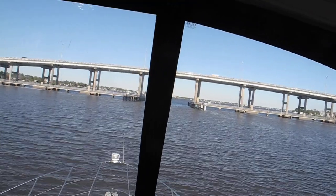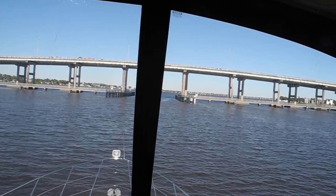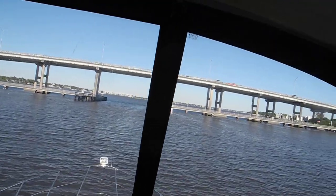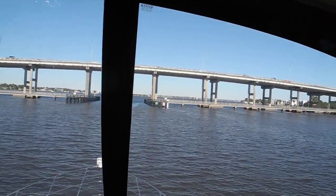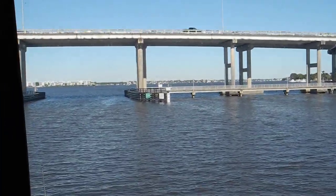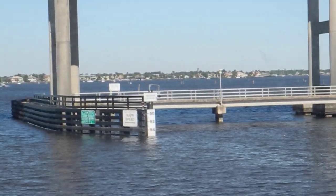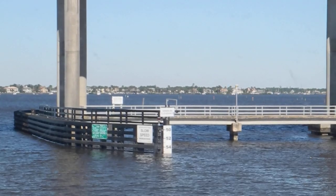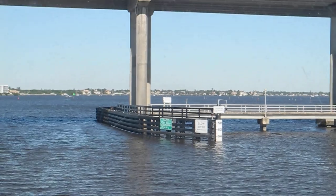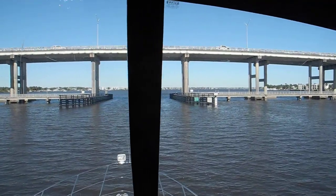You're having to learn how to feel the boat act and react to the wind. So how tall is this bridge? It's 60... 65? Look at the ruler over there — what does the ruler say? Maximum clearance is 50... 55. We see the number 54 and a little bit below that, so it's 55 feet air clearance. And of course that changes with the tide, so your clearance changes up and down with the tide.